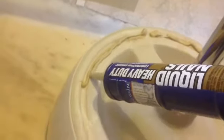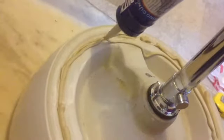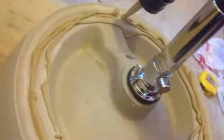Now this is how we're going to put the liquid nail. We're going to secure this vessel sink to the wood countertop by using a liquid nail construction adhesive — heavy duty liquid nail. Remember, when it dries, it dries permanently. It's on there pretty good. So if you ever had to take this off, you would destroy part of the cabinet countertop. Only do this if you don't ever want to take the sink off — and there's no reason why you would want to once your sink is in place.